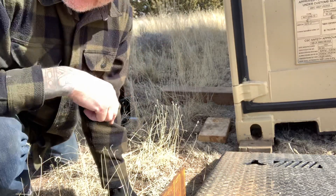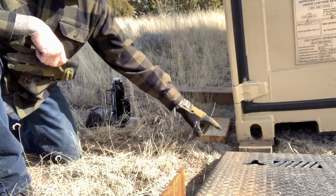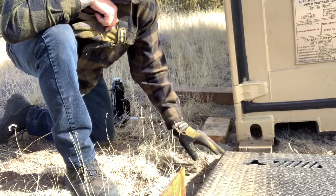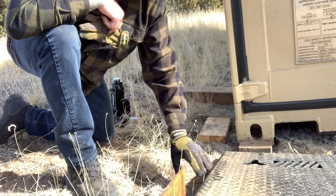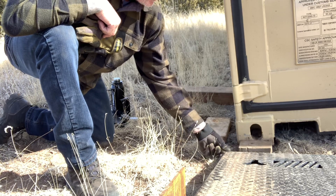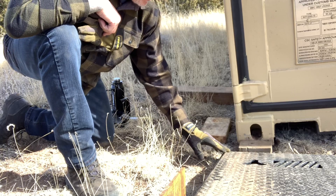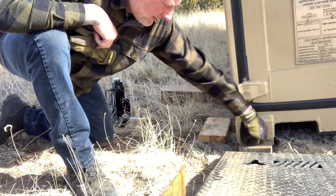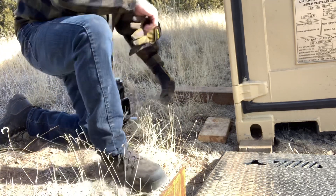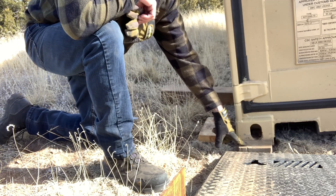Okay guys, we have a shipping container on the ground. This isn't a traditional knife blade — this is an equipment trailer I use for containers. It has about a half-inch to one-inch step here instead of a complete knife blade. I could pound this out and make it work, but it's a minor inconvenience — I just can't scoop right off the ground like a lot of container trailers are designed to do. I have some skids down here.